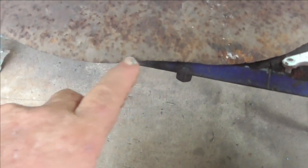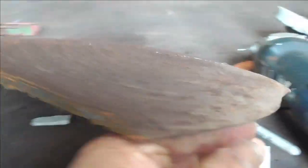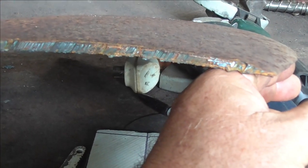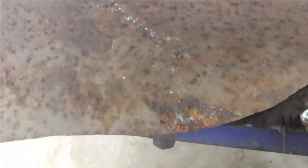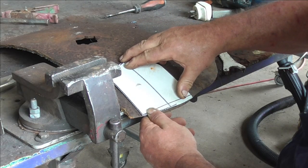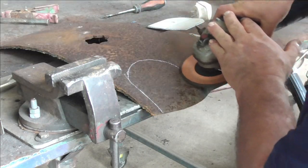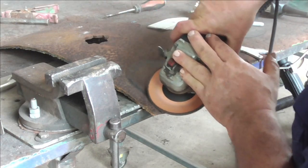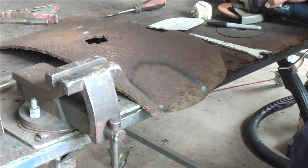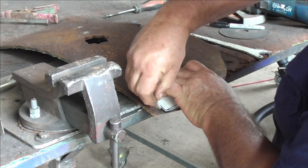If you look at the shape of the old plough disc where my finger is, you can see that there's a pronounced curve curving out and it's already sharp, so that's a good thing. And if you look, the shape's really good — it's curved and it's also a tapered piece of steel which has the strength up near the handle where you need it. So I'm just finding a place where it's appropriate to cut it out of, and what I'm doing here is cleaning the steel where I'm going to cut it with a plasma cutter, just to make sure it cuts easily.